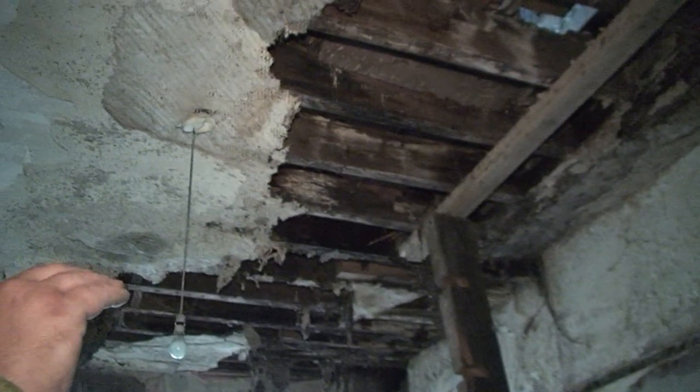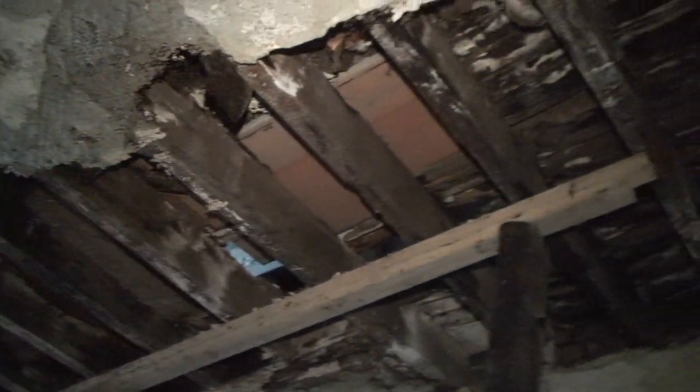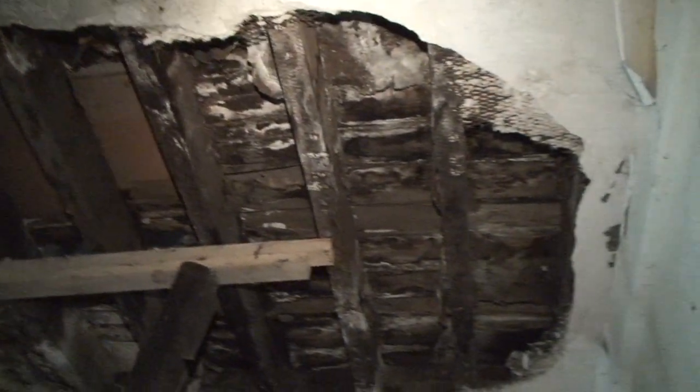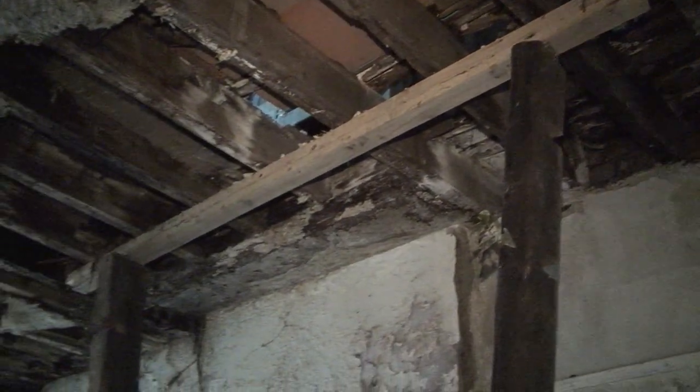As you can see, the joists are all rotten here. So before we can shore the next floor up, we're about to shore up from the ground stairs to this level, and from this level to the next level. We're about to continue that all the way up to shore up the roof, because the roof had actually collapsed. But we couldn't put any extra load on these beams, because these are rotted out.